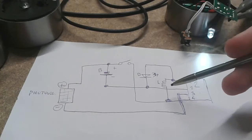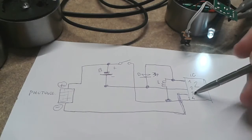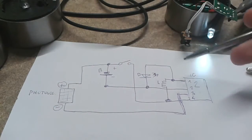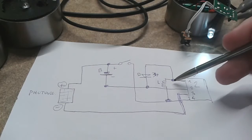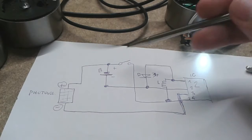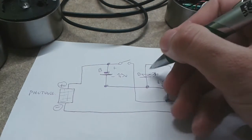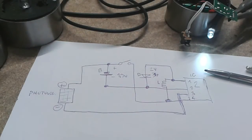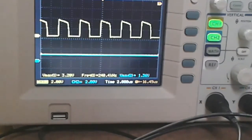Here is the PCB circuit reverse engineered. When the battery is charging, this chip apparently connects these two pins and voltage from the photovoltaic goes directly to the battery. When it's night, this IC acts as a DC boost circuit — this inductor is switching on and off. The IC takes the battery voltage of about 1.3 volts and boosts it to approximately 2 volts for the LED diode. As you can see, the circuit is switching at a frequency of 240 kHz.